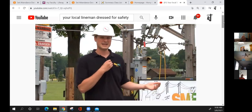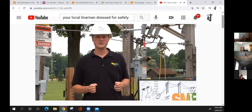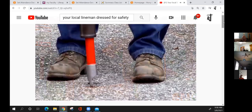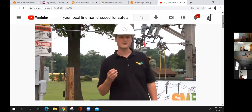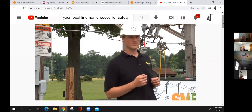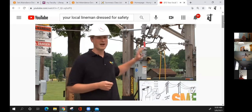Moving through the uniform — it's a fire-retardant material designed to automatically self-extinguish in an arc flash environment. As soon as it ignites, it goes out. If you're wearing synthetic material, it will actually burn and melt into your skin. That's why they say sometimes you're better off naked than wearing synthetic clothing in an arc flash. Lastly, their steel-toe boots have a step potential value of up to 20,000 volts. Step potential is an electrical phenomenon where ripples of electricity radiate from a center point — like ripples in a pond — and if you put one foot on one ripple and one on another, you bridge the gap between potentials.